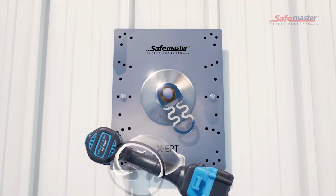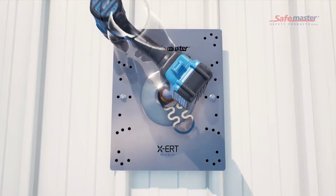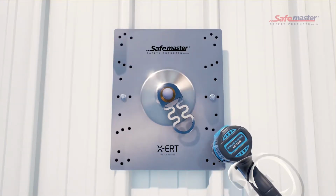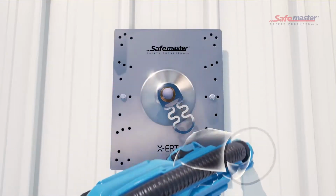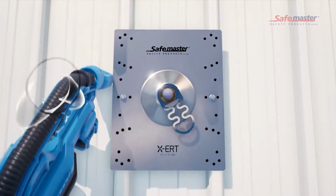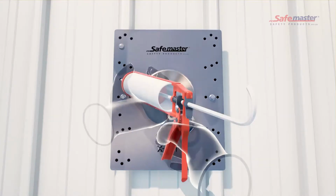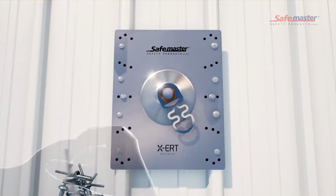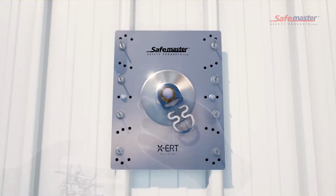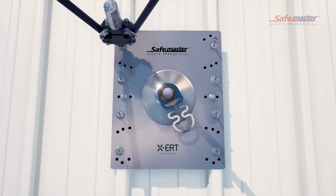Drill the remaining holes using an 8mm drill bit. Confirm the holes are correct before drilling, as you don't want to put unwanted holes in the roof to create a leak. And remember, always remove swarf with a vacuum to prevent the roof sheet from staining or rusting. Apply silicone onto each drilled hole, ideally enough to cover it. Insert crosspoint bulb-tight rivets and fix with a Gesipa riveter. Push down firmly whilst riveting to ensure it is properly engaged.